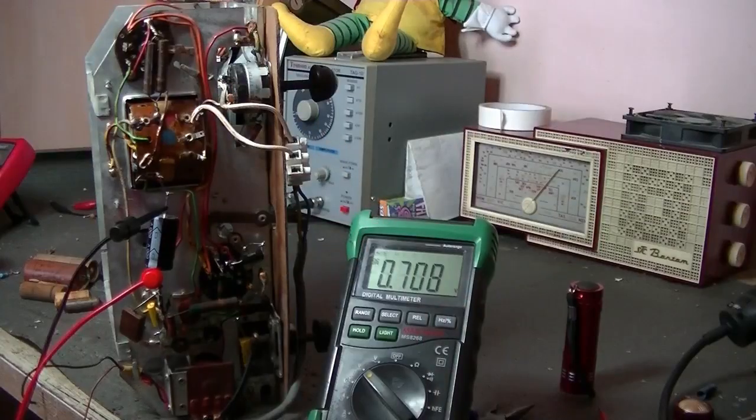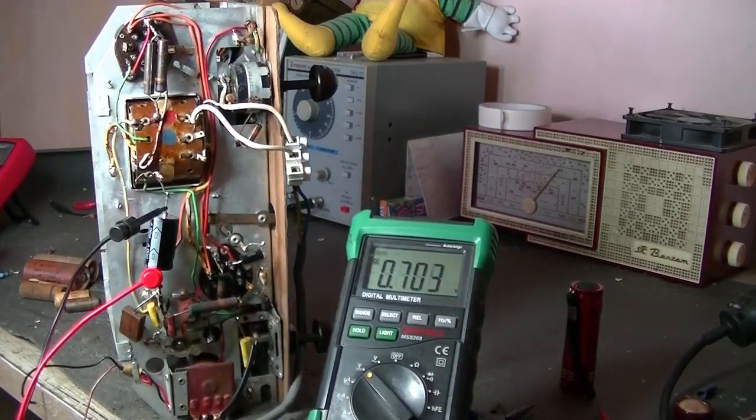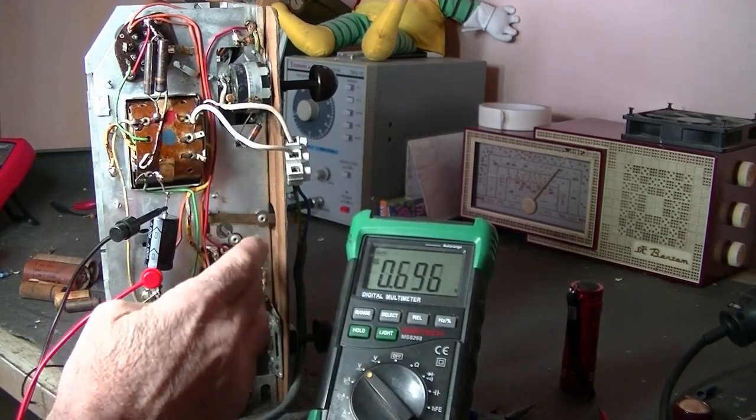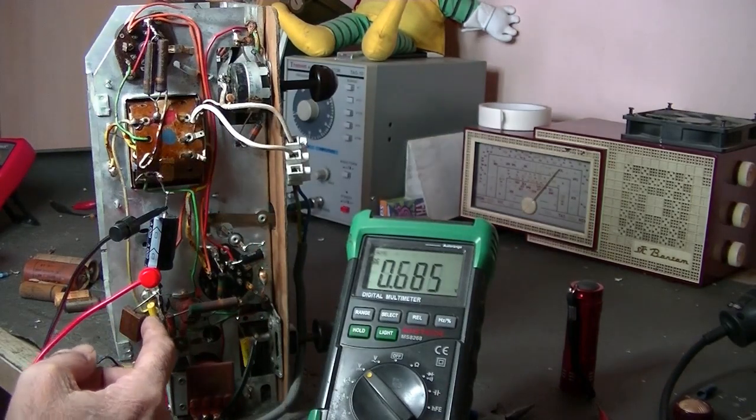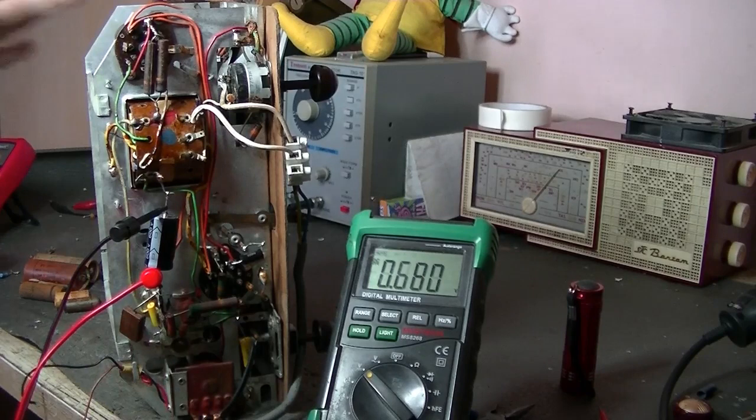Well, I've changed four caps so far. Nothing of any consequence, I don't think. One off the tone control, 0.1 there, 1.0 something or other there, and one on the back there, just 0.0047. So let's see if that's improved any. There's still about, I think, three caps to go. A couple of brown turds and another waxy. Well, voltage looking good. Sort of.